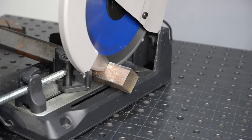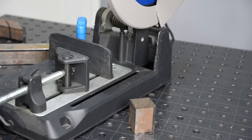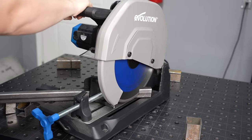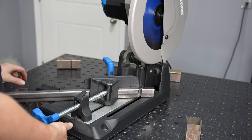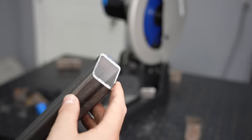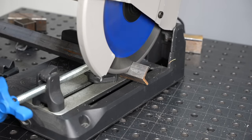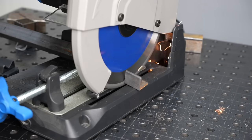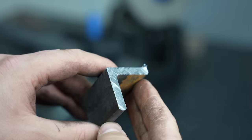This is the same saw as the other one. This blade has a thousand or more cuts on it where the other one was brand new, and it still cuts through really well — that's one thing I love about them. With the miter cut, it just cruises right through. The big thing you get are those convenience factors with the base compared to the CPSL; the actual cutting performance is very similar. Even with a quarter-inch thick angle piece, it just moves right through. I regulate my speed when cutting something thicker, and the cut finish has that unique almost-machined look with almost no burrs — pretty much ready for fabrication.